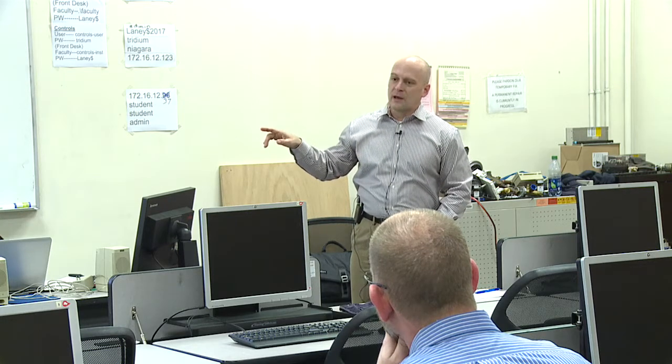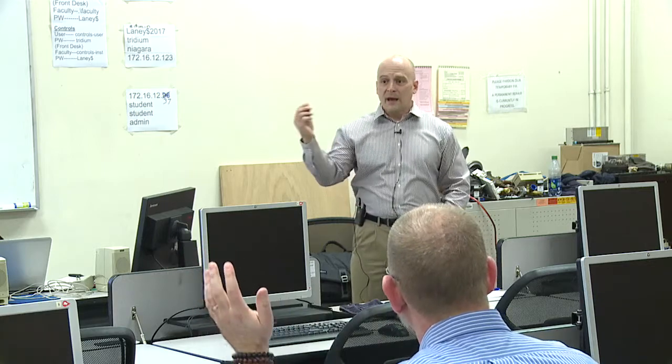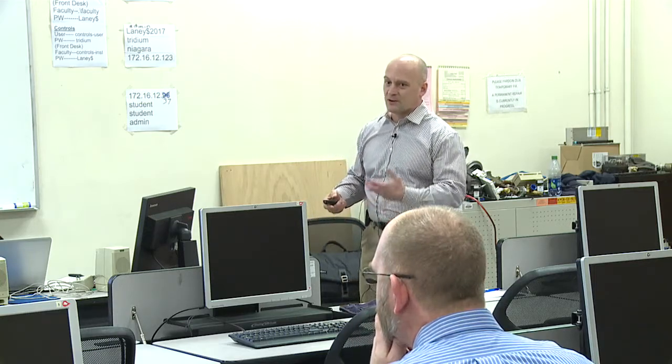And the reason for that is, how many have had experience in pneumatics? In the pneumatic world, there was a 3 to 15, the same thing, we had a live zero pressure of 3 psi G for the same reason. We wanted to know if a tube was cut, right? We wanted to know if the compressor is maintaining pressure. It just tells you the same stuff that in the old pneumatic systems, that you have a live zero.